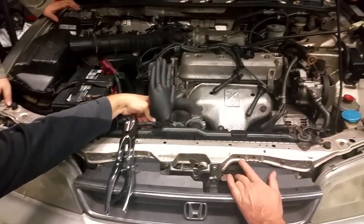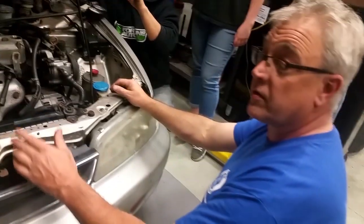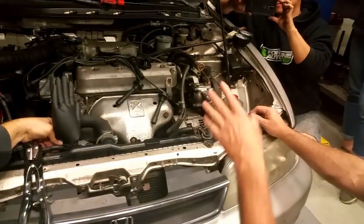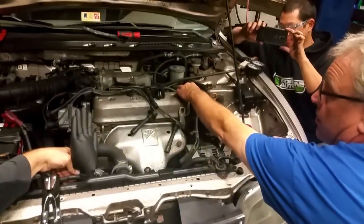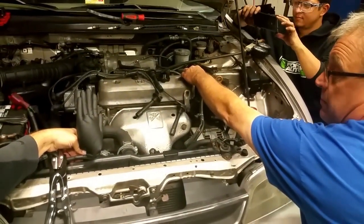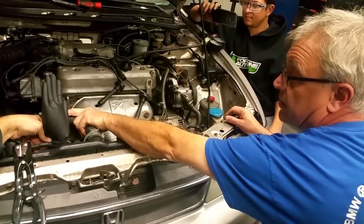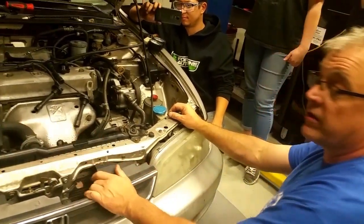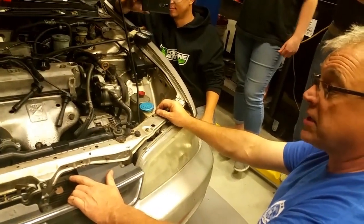You're probably not going to find a glove on top of that in any textbooks, but it works — this works very well for finding discreet air leaks. I've done it on different applications. You could do the same thing up here if you thought you had a discreet air leak coming up here. It's hard to seal that, but on a sealed system like this, it's very easy to seal that off and hook that up. And we can use that to see if I have a discreet air leak coming through the combustion chamber.